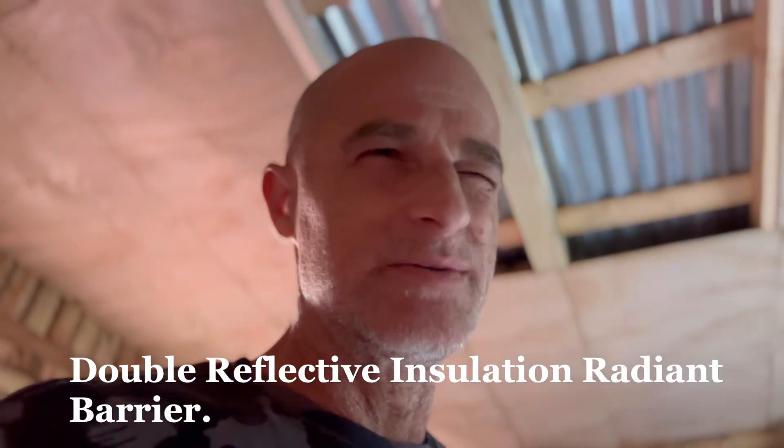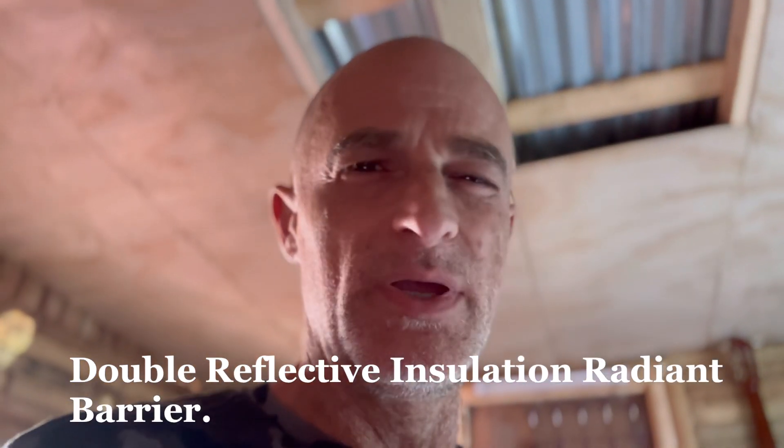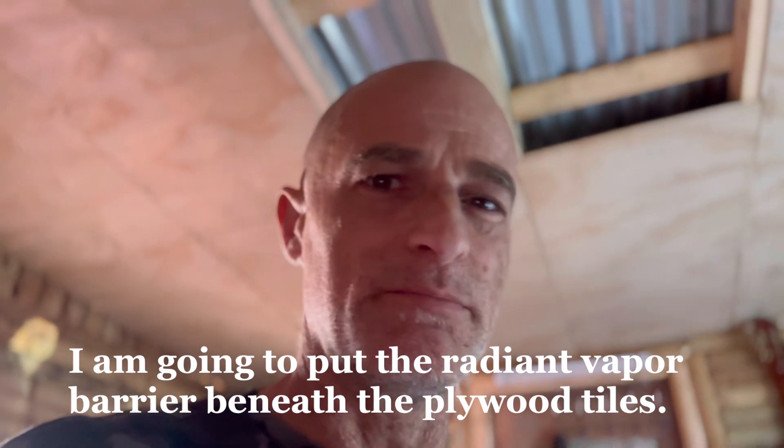In conclusion, there's really only two ways to deal with a sweaty roof that's already installed. One is to spray foam the crap out of it. You can also, if you really want to do it, get some really thin three millimeter barrier — it's kind of foamy, it's got a metal exterior to it. What that does is prevent the hot air in here from rising to the tin roof and creating the sweat.